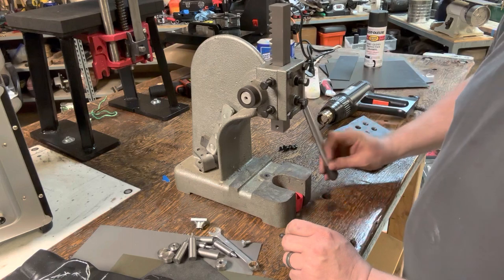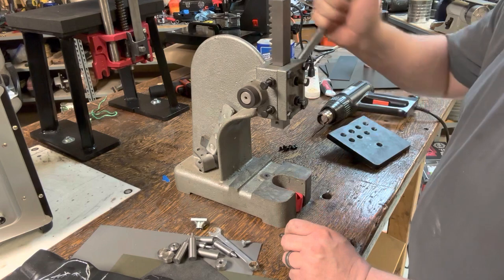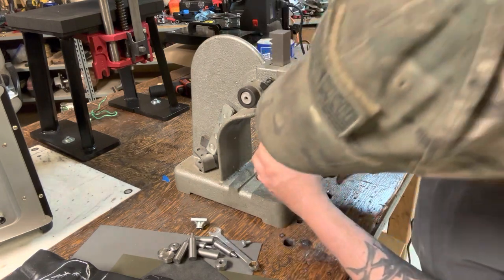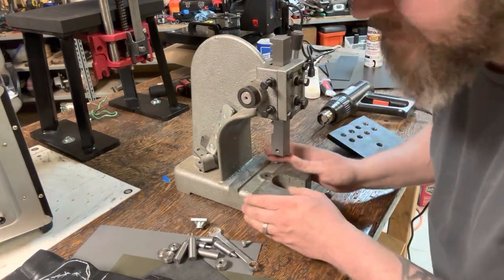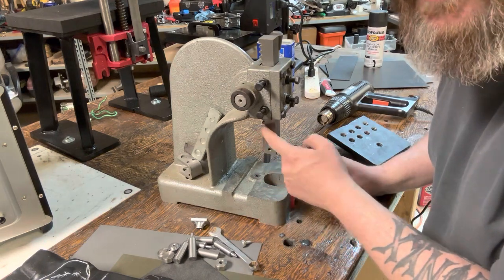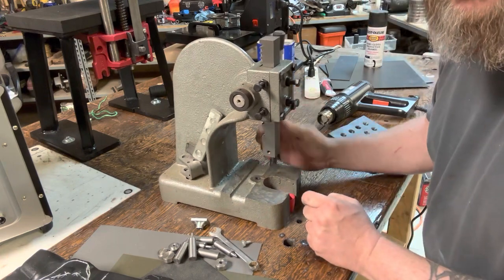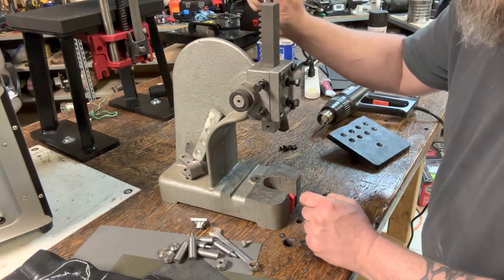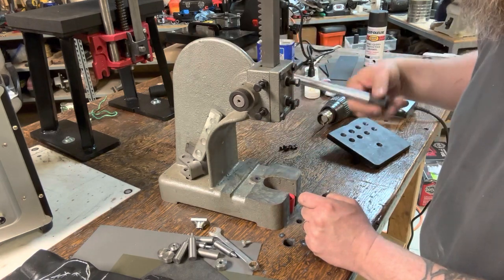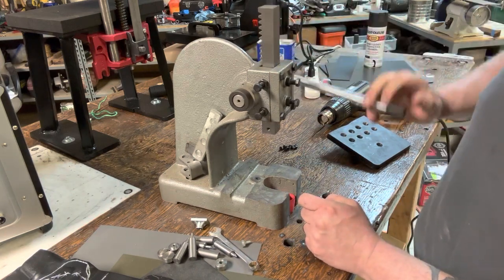Like a ratcheting, so let's say you're in the wrong place to get real good pressure, you can come up and ratchet. Like, oh, I want it from here, you can ratchet down. You can go on YouTube and look up modifications to these arbor presses, but you see I ground off the teeth right here on this last little part. The only effect that has is that when it goes all the way up, it starts skipping teeth, and that allows you to ratchet to wherever you want to go to bring it down. Okay, so that's the first mod.